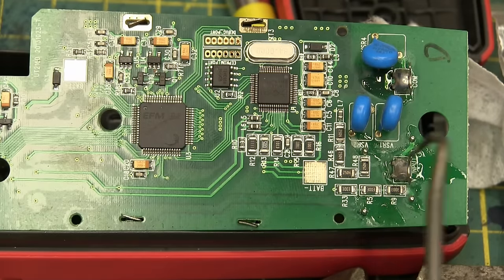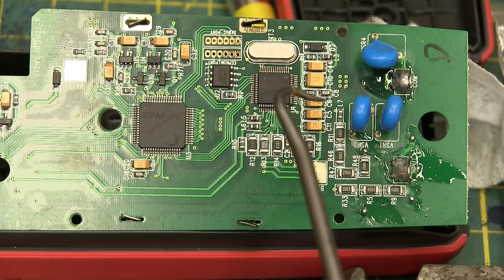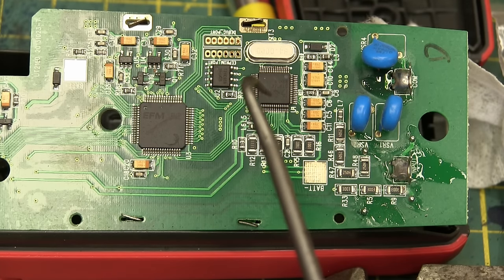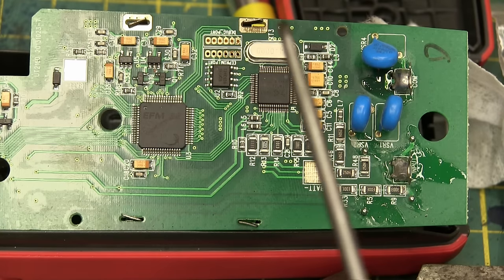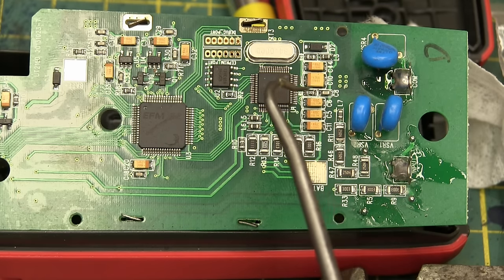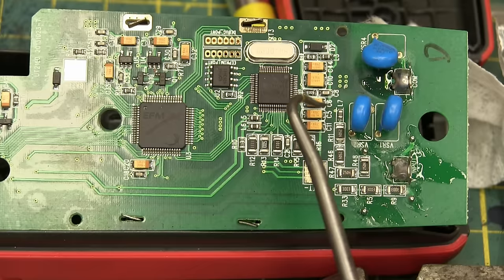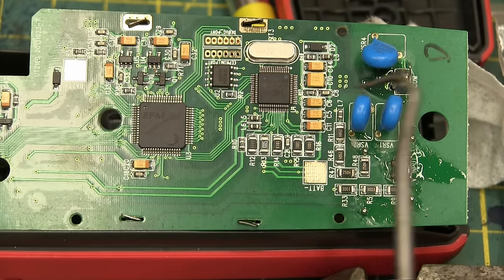Starting from the input, we have these surface mount resistors and these transient voltage suppressors — MOVs actually. These are a CNR07D681K. I'm going to start naming the components, especially the ICs, because someone asked me to — if they want to bodge something together that's similar, it's nice to know what chip somebody else has already used so they don't need to reinvent the wheel. These are 420 volt AC nominal with a 1.1 kilovolt clamping and they'll take 1,200 amps — obviously not for very long, look at the size of them. So these are what's protecting us for the CAT 2 and CAT 3 rating.